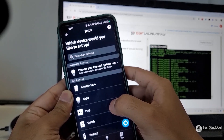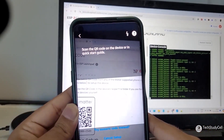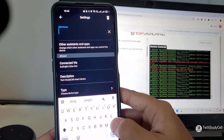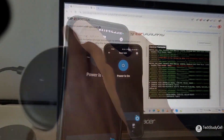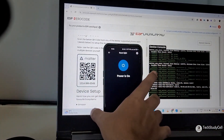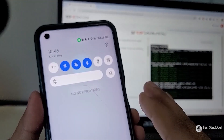Here is my Echo Dot. I will quickly open the Amazon Alexa app and also turn on Bluetooth and location in my mobile. Then follow these simple steps to scan the Matter QR code with the Amazon Alexa app. After that, all the devices will be added in your Alexa dashboard, and you can also rename those devices according to your requirement. Now your project is ready — only the Echo Dot and ESP32 must be connected with the same Wi-Fi network. But you can connect your mobile to different networks, so you can control these appliances from anywhere in the world.